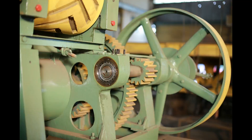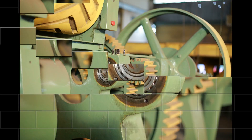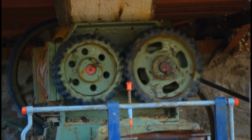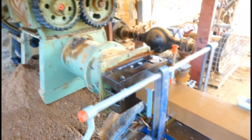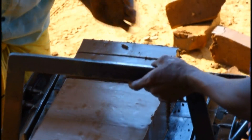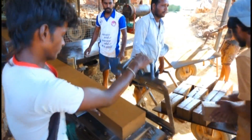The shafts and rotating parts are suspended by heavy-duty roller and ball bearings according to the load of the machine. The extruded clay is cut into predetermined lengths using a manual brick cutting machine after the extrusion process.